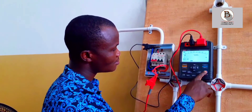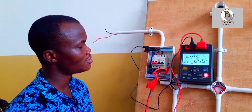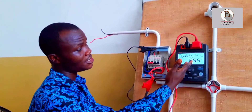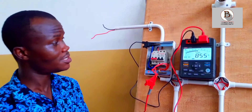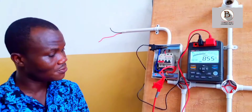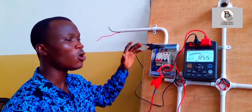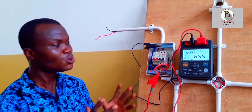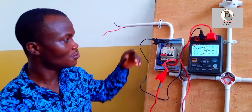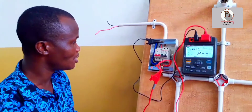We are now carrying out insulation resistance between the live conductors and the neutral conductors in the circuit. The reading starts — 7 seconds, 8 seconds, 9 seconds, 10 seconds. My 10 seconds is up, and that is the reading I have for insulation resistance between live and neutral. It simply means the live wires connecting to either the power circuit or the lighting circuit, and all the neutral wires in the circuit — there is no leakage between any of these cables. We have a reading of 855 mega ohms. That is a very high resistance.